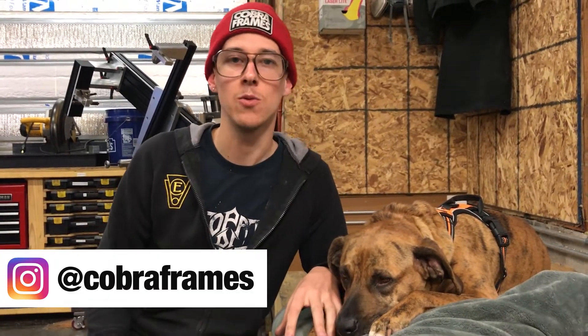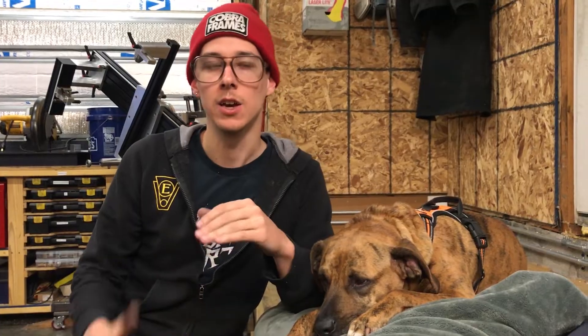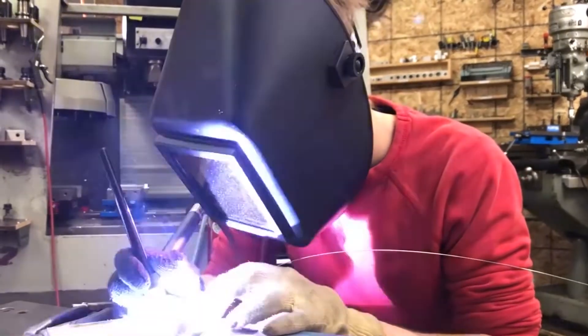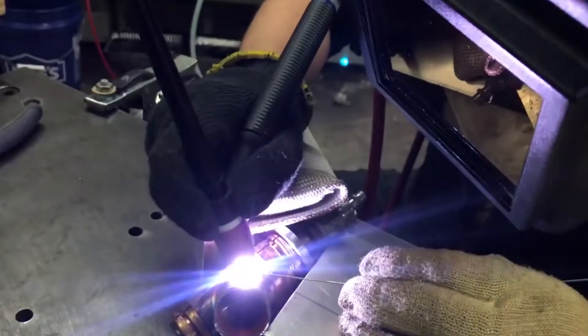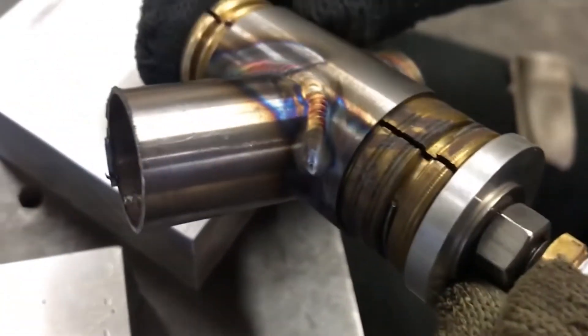To get technical, let me explain the basic difference between welding and brazing. Let's say you wanted to join two pieces of steel into a 90-degree corner joint and you wanted to add a little bit of filler between the two of them. With welding, you take both of them and you heat them up to their melting point - the steel goes from frozen solid to liquid melted steel at the place where they meet. You fuse them together using a heat source like a torch or an arc. Generally you'll add a filler that's basically the same as the parent material, so you melt steel, steel, and a steel filler rod all slightly above the temperature where steel melts, pool them together along that edge to make a weld bead, and the three pieces become one solid united piece of steel.